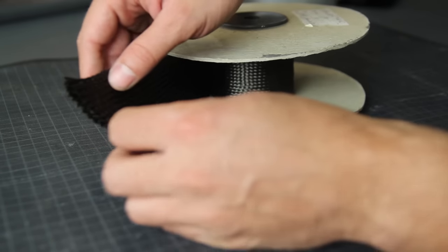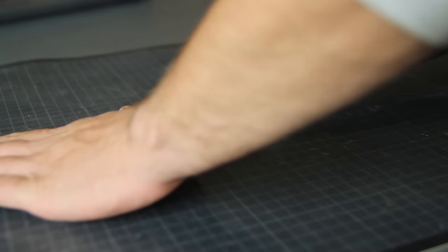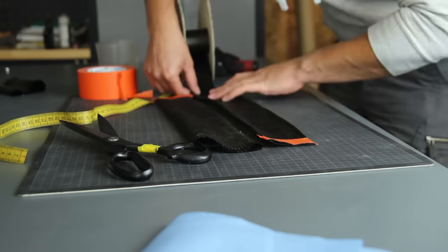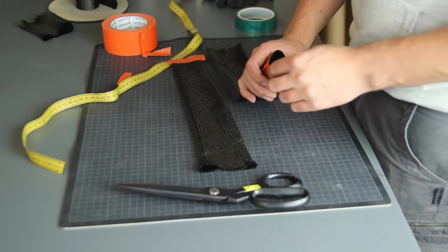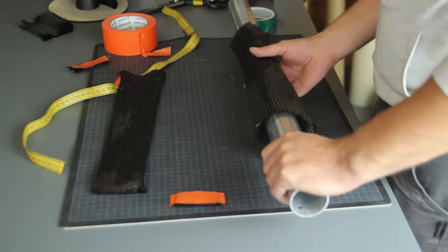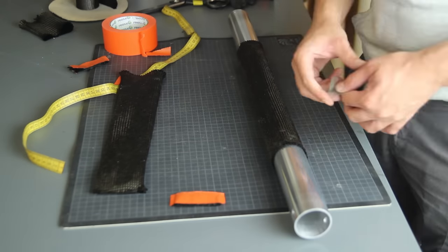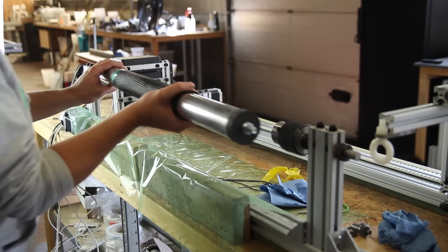The second technique is a braided sleeve, woven at plus 45 and minus 45 degrees normally. You can use different diameters of tubes, which influences the fiber alignment — the smaller the tube, the more the fibers approach 0/90 degrees. The wider the tube, the more angle you get. Mostly when you buy them they'll show a minimum and maximum diameter.